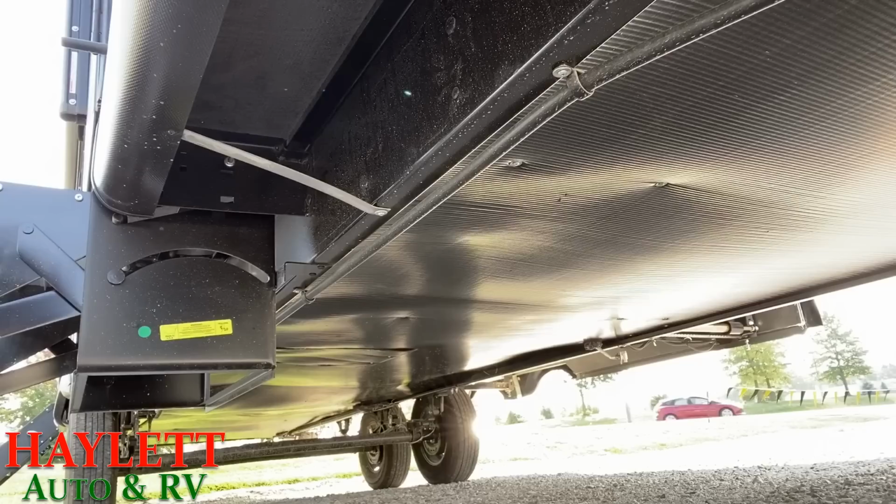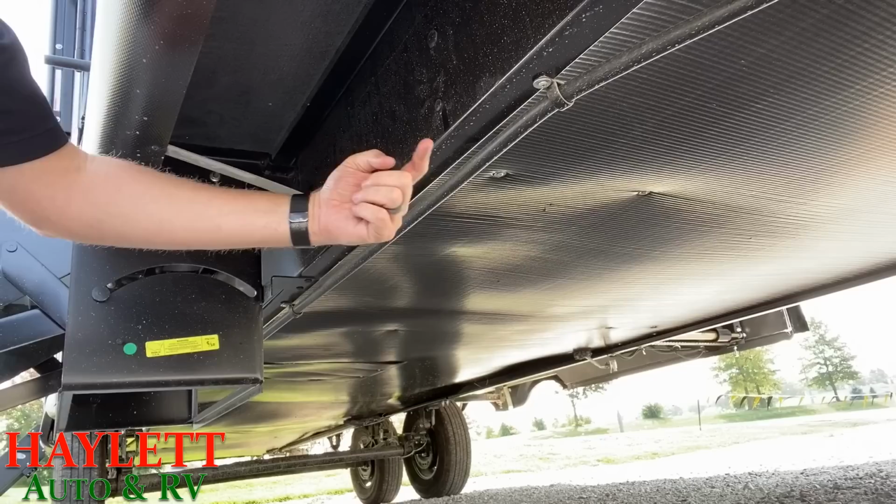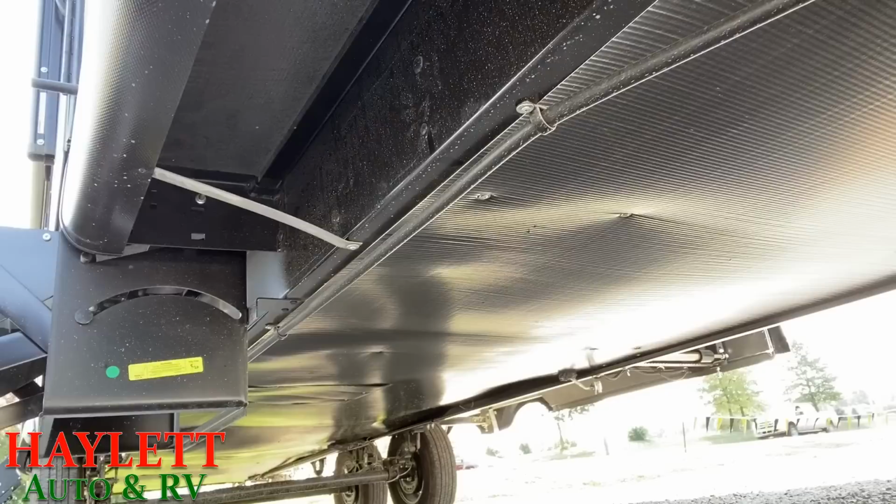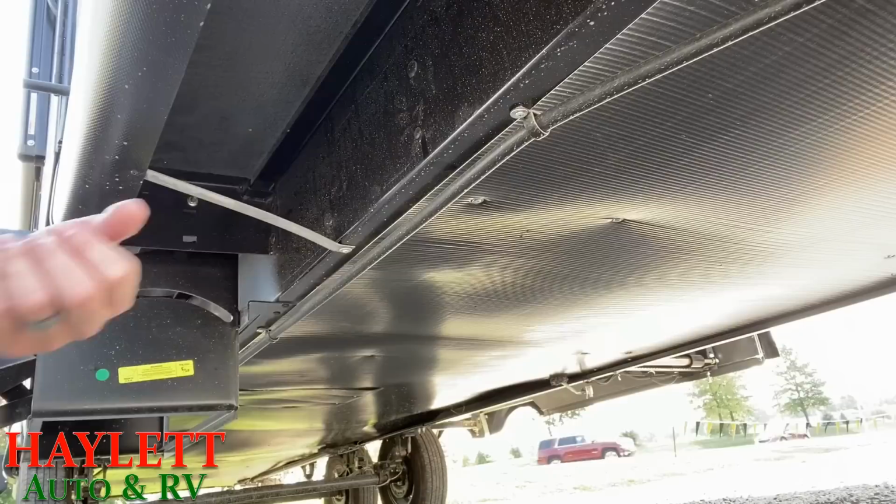Now, White Hawk runs on a different chassis. You notice that it's not an I-beam. There's only one, there's not a flange here. It's a Z-frame. It is made by a company called Norco. It is a Huck-bolted ultralight chassis, very similar in construction method to something like an aircraft, basically. It is lighter weight. It is generally a little bit stronger, but it does cost more.